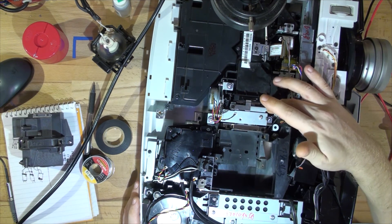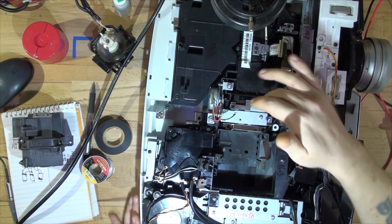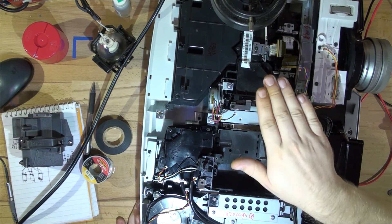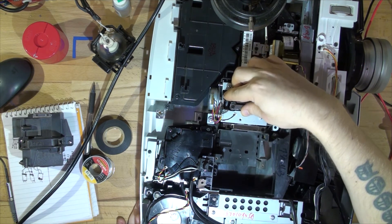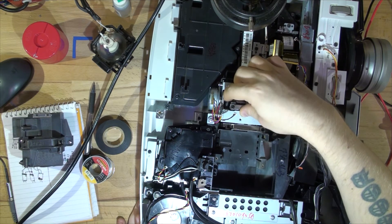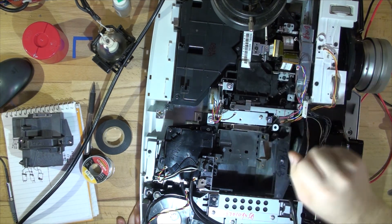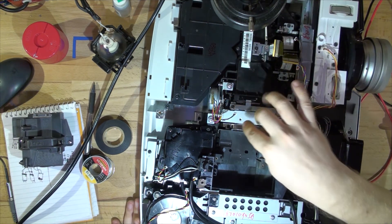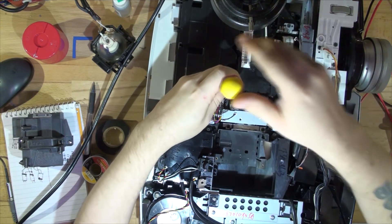The two red lights flashing means a problem with either the cinema slider or the iris. In my case it's the iris. When you turn the projector on, the cinema filter slides in and out as a self-check, then the iris starts moving and gets stuck in one spot. When I move the wheel here it feels a bit stiff on that exact spot. The projector keeps trying, tests everything including fans and sensors, briefly turns the light on and off to check for other faults, then gives the error. So we know the problem is the shutter — I'm going to open it up and lubricate it.